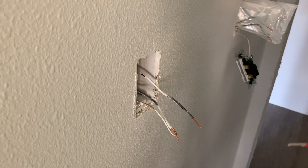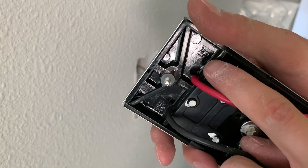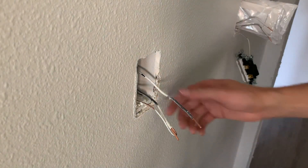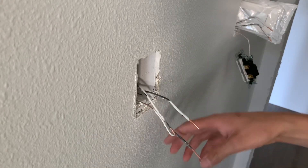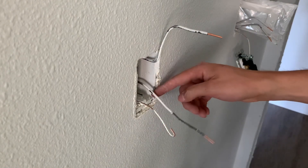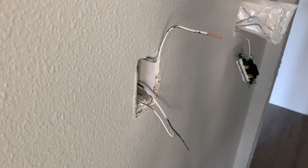It is specific — make sure: most of them are, but the black wire is the load and the red is the line, so that means your red is your power and black goes down to the heater or switch leg. In the box it's kind of hard to tell, but none of these are labeled. It only takes a second to know which one goes where because the power comes from the top, and the wire going down to the heater straight below is coming out of this wire right here. So I already know this wire is going straight down a couple feet to the heater — this is my load, and that's going to go to my black wire.